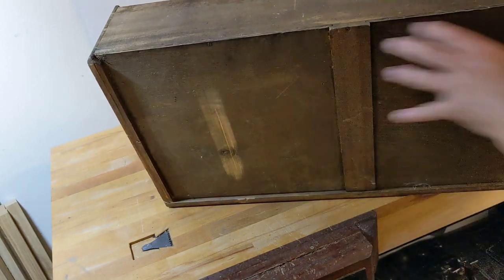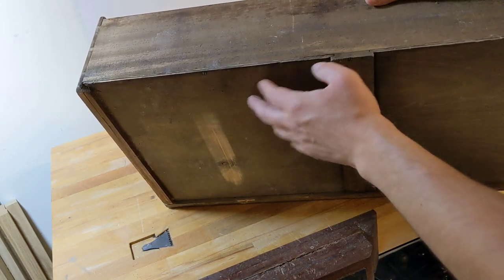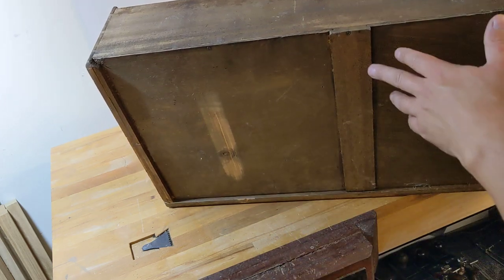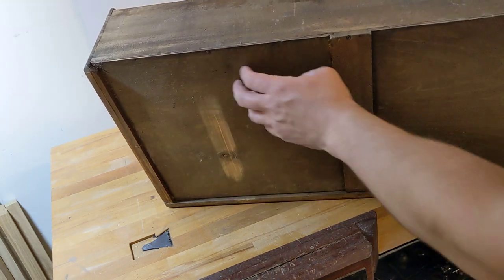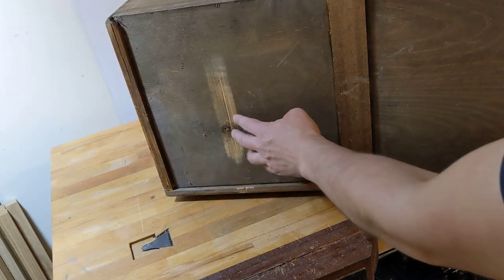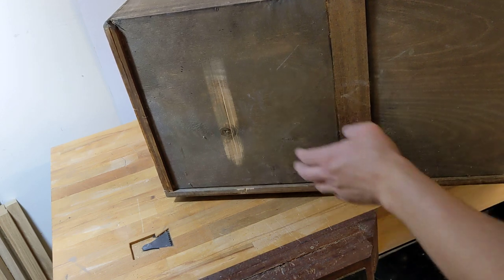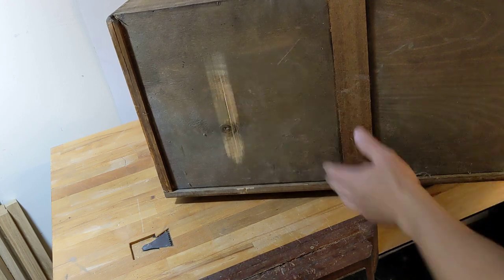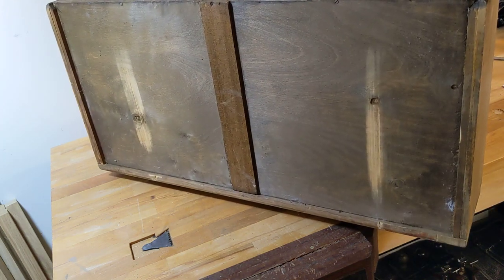We've got the muntin as well, because unfortunately, being mass manufactured furniture, it's got very thin plywood in there, probably only about maybe 4 mil. It's quite thin, and you've got a muntin with a groove there to try and cut the amount of downward pressure. But you can see here that either these drawers were stuffed full of too much weight, or that plywood was just a bit too thin or it distorted, because it started to rub, or something got trapped, same there, started to rub and was getting damaged over time.